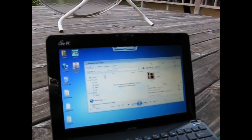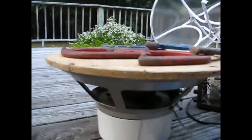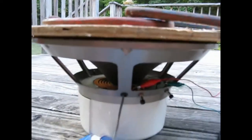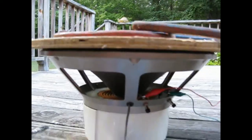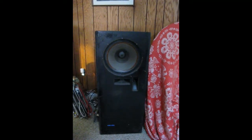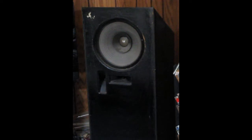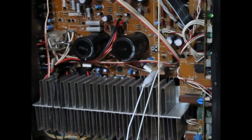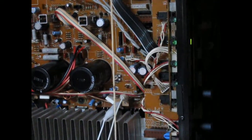I'm using Botany Bay for a music source, putting the weights back on. It just seems to be more efficient, especially in the mid-bass. I'm running the Yamaha Class AB1 because the bias just isn't stable enough to maintain AB2 — I'm still going to be working on this amp a little bit more. I've got the amp set to flat and set to mono so I can compare these speakers.